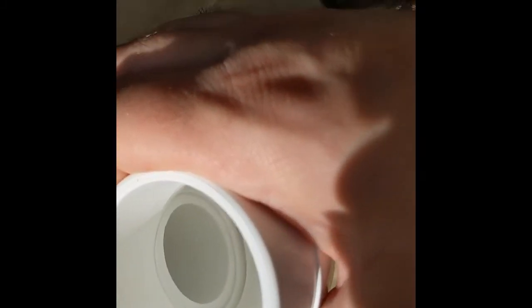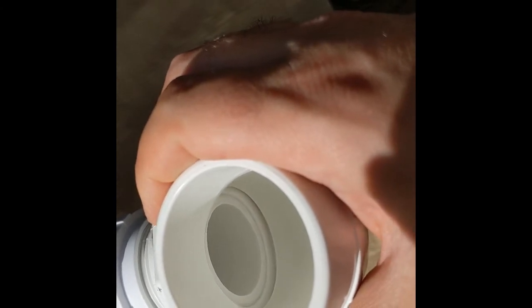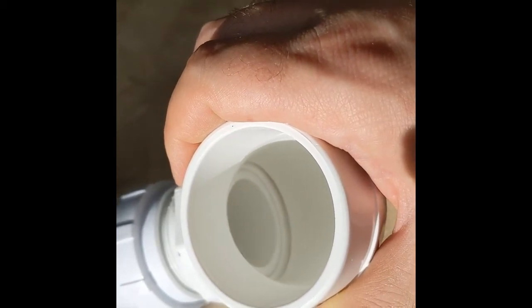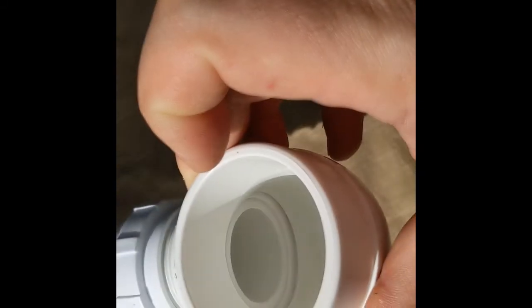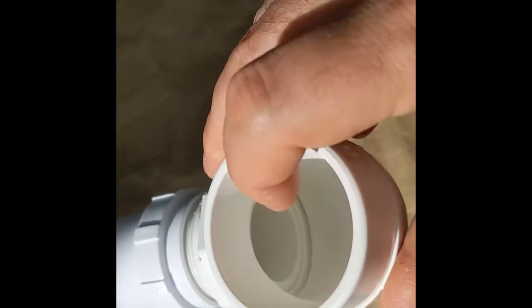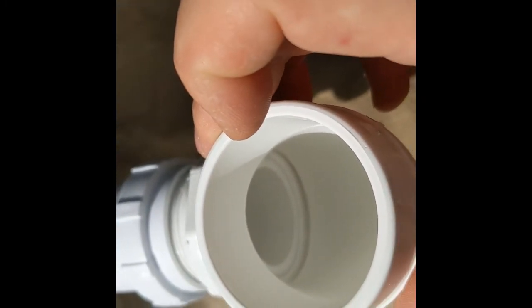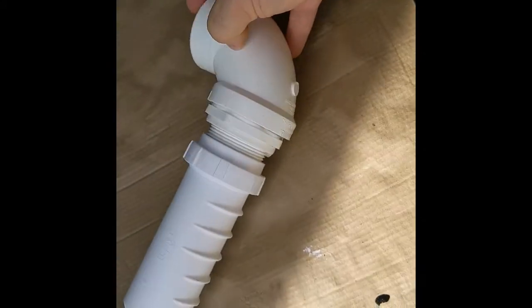Also, another reason why I cut them is because you'll see when you go to Lowe's, if you're going to do it this way, it had a really big ridge in it, which I didn't like. I don't want it to obstruct the flow of water. So I cut, you can actually see the two pipes in there that are coming together. One is the slip and one is the 1.5 to 1.5-inch threaded, and I cut it as close as I could together, but you'll see what I mean when you put it all together before you cut it, that it just doesn't look right. So I used a chop saw to cut it. Anyway,